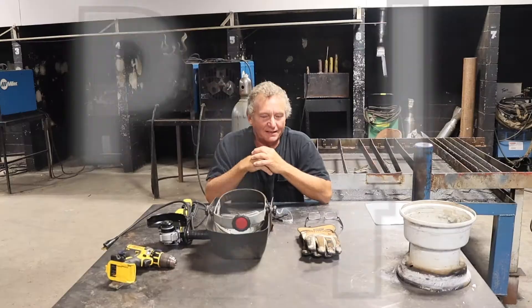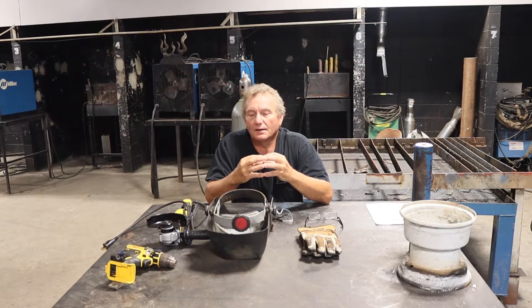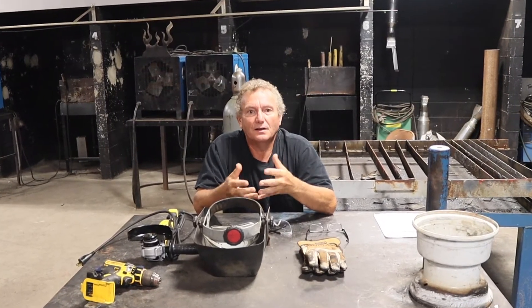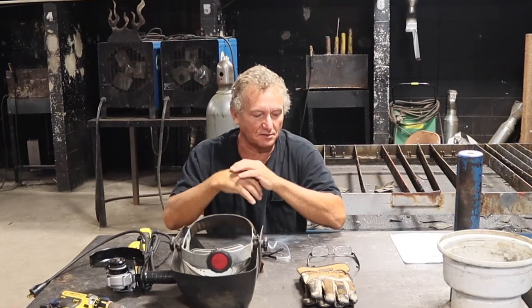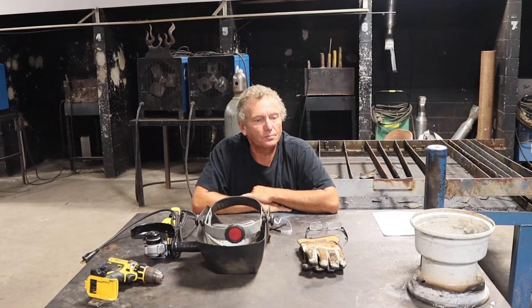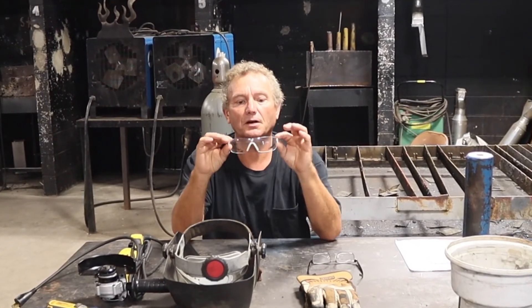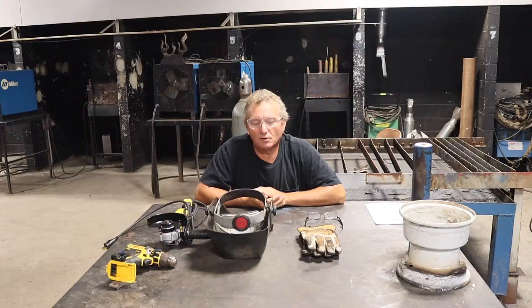There's what we call PPE — Personal Protective Equipment. Your welding class is not going to be like any other class you've got, and the reason for that is welding: you're dealing with a tremendous amount of heat or fire, and that poses a different set of guidelines we have to go by to protect ourselves. The first thing — always protect your eyes. Your eyes are precious. If you lose an eye, you're just at a disadvantage any way you go. The rule is, if we're out in the shop, then we have on a pair of safety glasses. There is no exception to that.